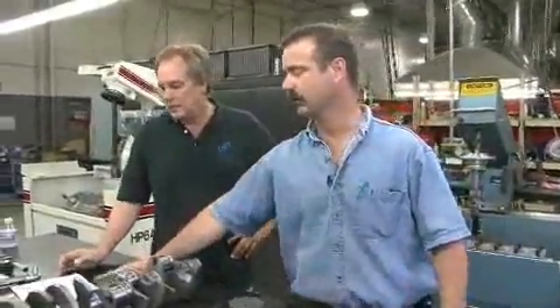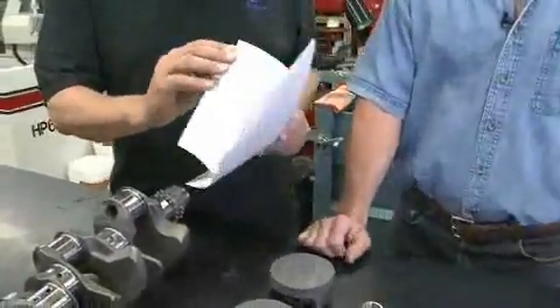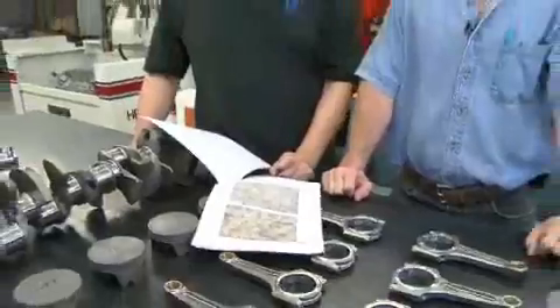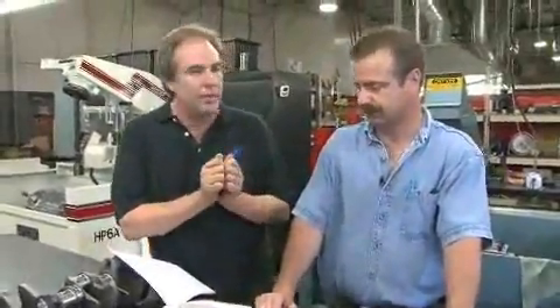One of the things that we found when we had an outside source doing our machining was that the surface roughness was outside the specifications called for for this type of material. After doing some research, we made some recommendations to cutter rotational speed and feed speed. We did some outside testing for quality control, and that actually showed us that we had correctly identified what would have been a manufacturing flaw and then came up with a good countermeasure to take care of that. We actually take acetate tape and put it on the bore, then take the tape out and put it under a microscope. The microscope tells you how much damage there is to the silicon nodules on the bore. Then you can refine the boring and honing process to retain the maximum amount of silicon. The silicon is actually what the piston glides on, and we actually make the silicon proud and push the aluminum back as a recess.